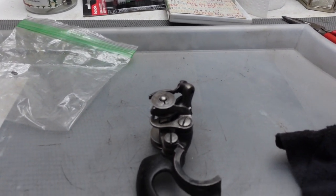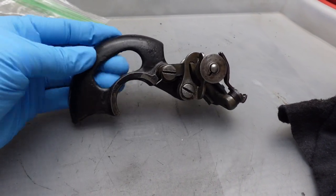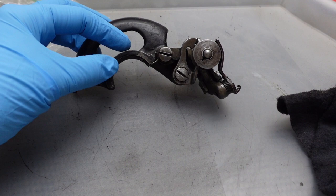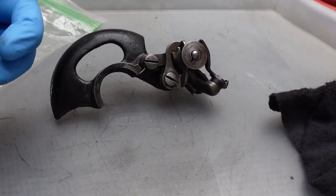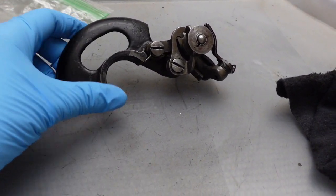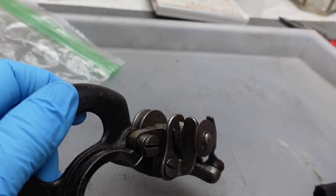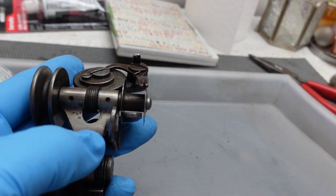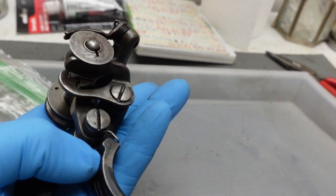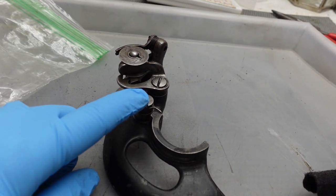I just deleted footage of me over in my painting room painting the first couple coats onto the machine — I changed my mind on the color, so it'll be a surprise. The machine has a few coats on it. I had masked off the centers and outside edges of the big wheel and have it getting painted. I'm going to take a little time to carefully disassemble the bobbin winder mechanism and take this belt guard piece. This bobbin winder mechanism — a lot of times on these the piece is painted cast iron, but on this one it is steel. I'll take it over to the shop, strip it, get it ready to paint, and then work on cleaning up this mechanism.